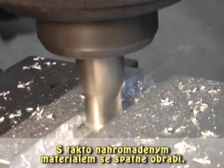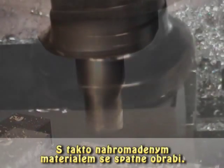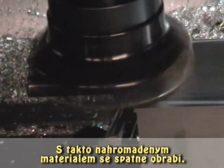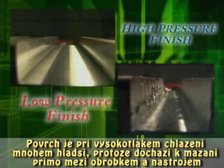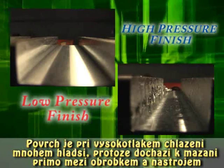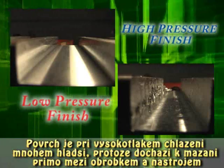Unfortunately, this blunt, ragged build-up doesn't cut very well — it drags and smears before breaking off. That's why mild steel often has dull streaks where the insert is loaded and shiny streaks where it's clean. High pressure cooling controls the temperature at the cutting edge, completely eliminating build-up edge as a problem. The surface finish is also much better because high pressure coolant forces the coolant to the cutting edge, tremendously increasing the actual amount of lubrication between the tool and the work surface.